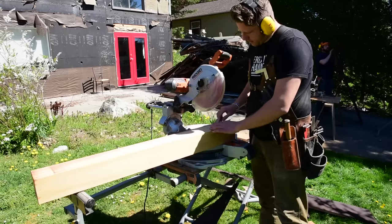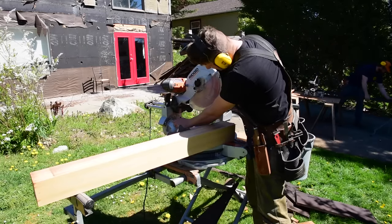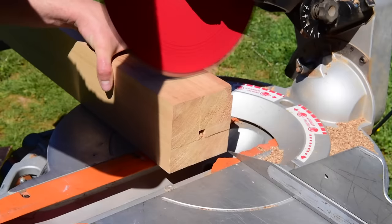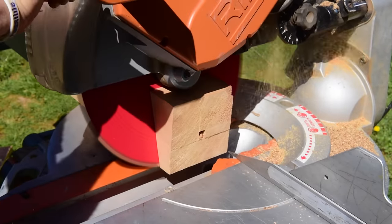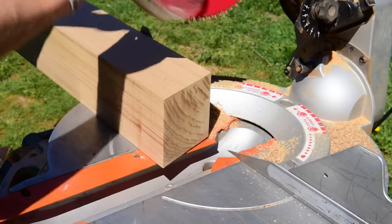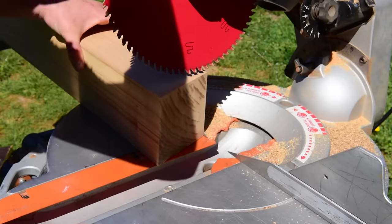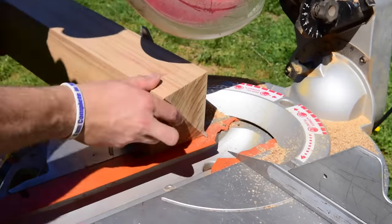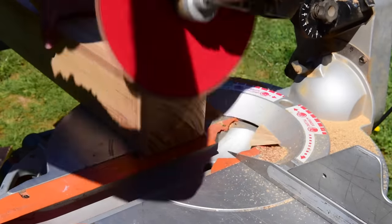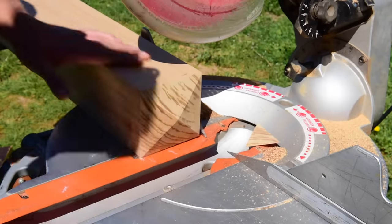What I've done to start is square the line all the way around all four sides, and now I'm going to facet the top of the new post — give it a little sexy look. I'm shooting her to 15 degrees, just following that line using this big ugly rigid saw here. My buddy Nate says my bearings are shot on my DeWalt — close enough. Fix the rest with a file.